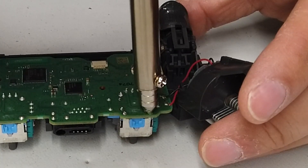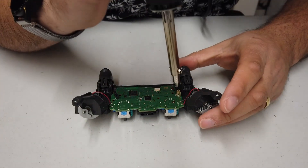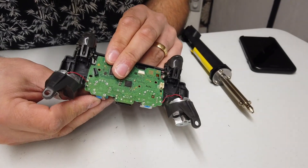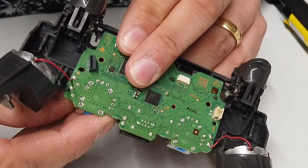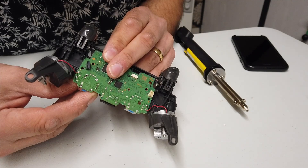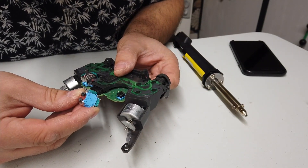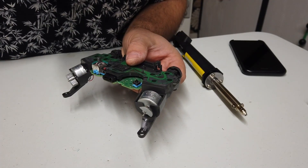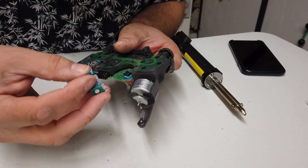This is looking really promising. I'll crack on with these and get some new ones in. Once you've got all of those pins desoldered you'll feel a little bit of compliance — a little wiggle — and what you can do is just very carefully pull that off the PCB. That's the used one, set aside, and we replace it with a brand spanking new one.